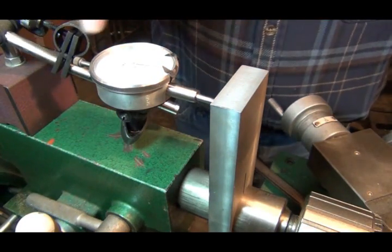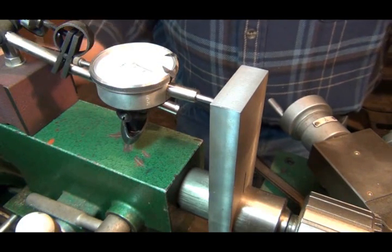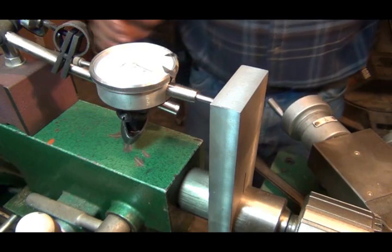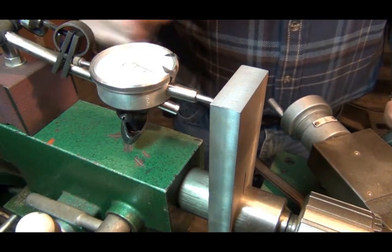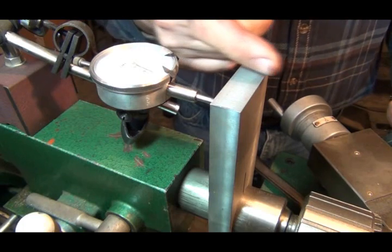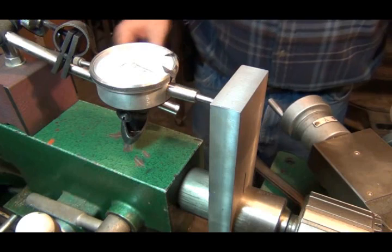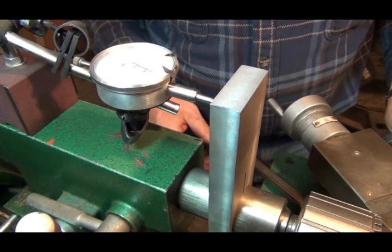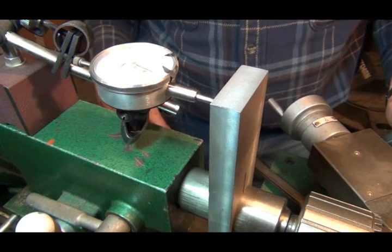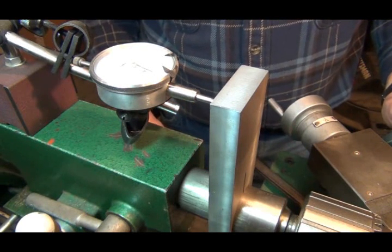Anyway, I gotta drill in until that dial goes around 5 times, and then I will have drilled in a 1/2 inch. And since the indicator rod's going to be coming out, it's preloaded with I think 0.6 on it, so I will have room to travel far enough. I hope you understand my babbling.